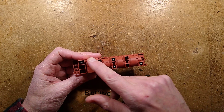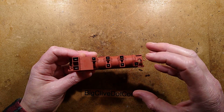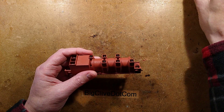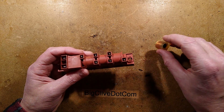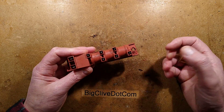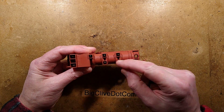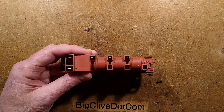This is a device designed to take mains voltage in, and it's got six terminals on the output. Based on observation, and knowing that many of these things contain multiple bobbin transformers, I'm going to guess it's got three of these inside, and that these are diagonally connected, and each pair is high voltage.